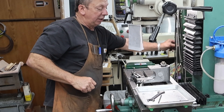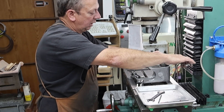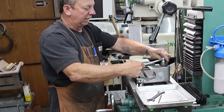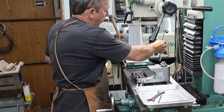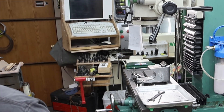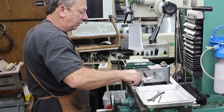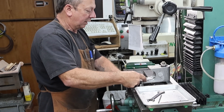If there's anything major wrong with it, we can still make some adjustments. I believe those end up being 3/8 bolts — that's what we're using as pivots for those. This doesn't need to be exceptionally tight; I just want it down flat with the table because I am using it as a reference point. So we're just going to bolt it down, drill this one hole through it, and then pull it back off.